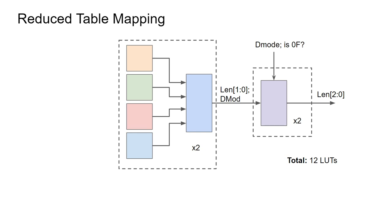In comparison, if we instead implemented the table as a 256-entry ROM, we would have something like this, which has a total of 12 LUTs. Note that this still has a logic delay of 3 LUTs, so the only difference is an increased resource usage of 33%. But that 33% can add up over 16 pre-decoders.